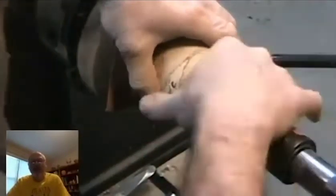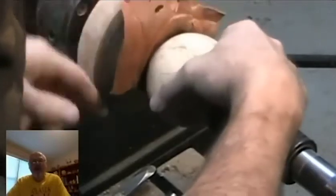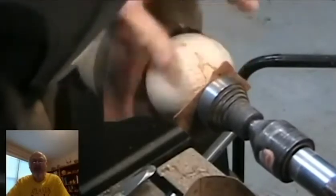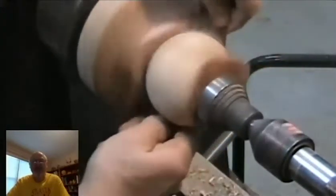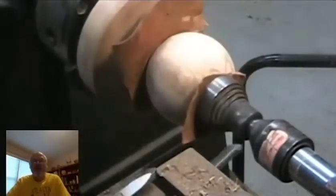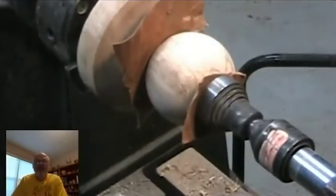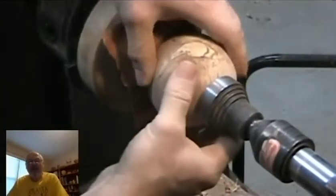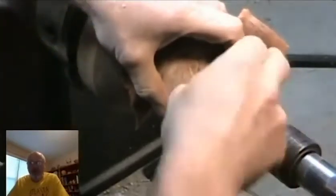Now I'm sanding. With sanding I'm probably starting at 120 grit here. You do have to sand on all three axes — X, Y, and Z — in order to get full coverage. I added leather on both sides of the cup chuck system so I don't damage the surface of the sphere. I usually sand hollow spheres like this to 320 or 400 grit, and I switch to wet sanding after 120 grit — at 240 grit I do wet sanding. I use walnut oil for that.